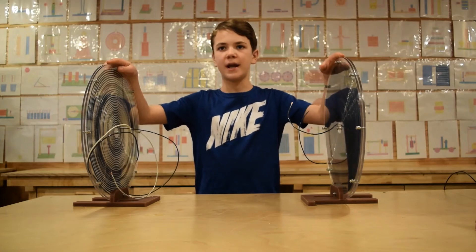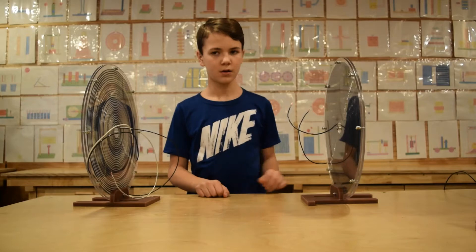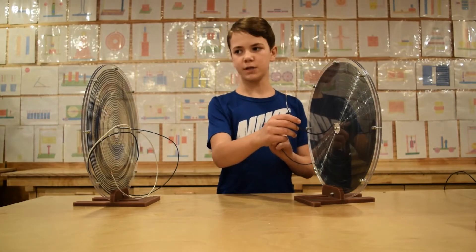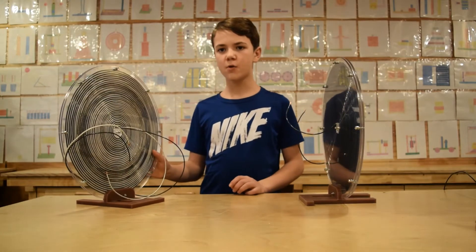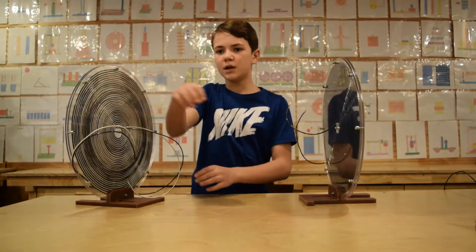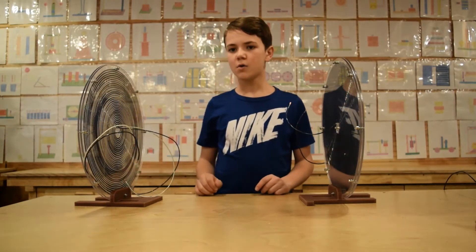Both coils are 16 inches in diameter and they use heavy gauge, low-resistance conductors that are very well insulated, so that a high voltage discharge circuit or a low voltage pulsating high frequency circuit can be used. This coil is a single coil, regular wound. This coil is a bifilar wound coil with two coils side by side. These coils can be connected in parallel or series to receive higher current or higher voltage. Both coils have stands that interlock.